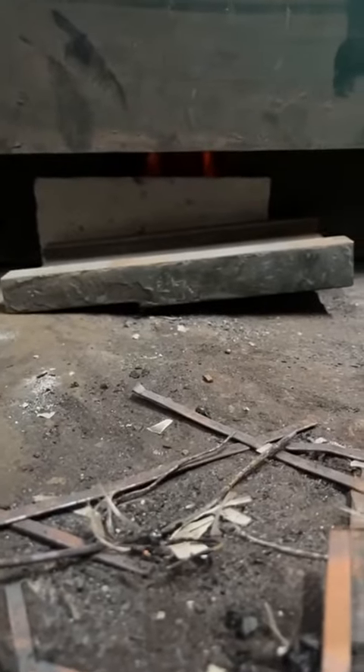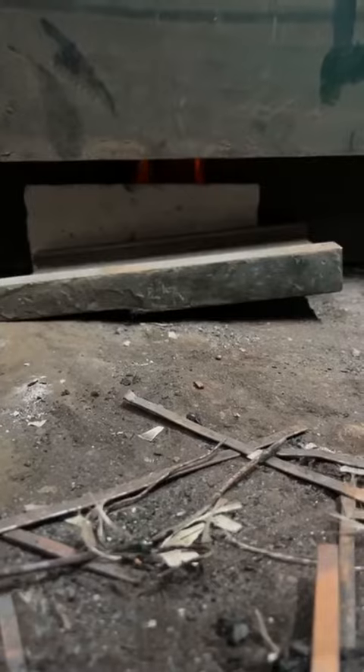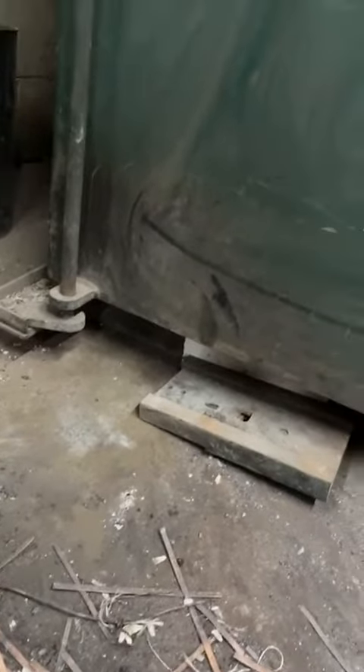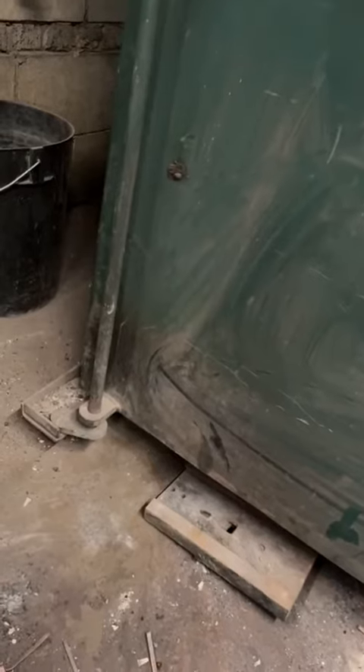That's our Beko tip of the day — you want to keep the process chamber with as little oxygen as possible, and that hole in the cart tracks is a source of oxygen. This is Dave the oven guy from Custom Designed Chemicals, working on this Beko oven. Everybody remember: keep the oxygen down from your process chamber.